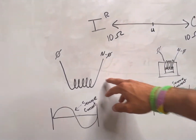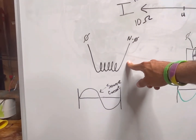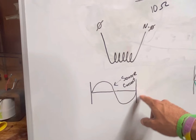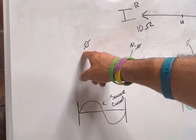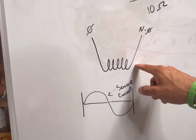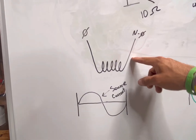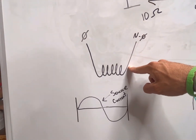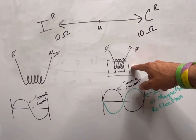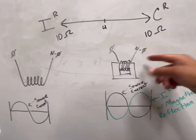Here is a snapshot of what's actually going on, looking at the sine wave between these two different scenarios. In this first one, we just have a regular coil standing alone. All we have on the sine wave is just a source current — it's completely unopposed. As we run current through this coil, it's going to rise and rise and rise, hit zero, and rise again. There's nothing opposing this other than the resistance of the wire itself, and with only that very minimal resistance, current flow is going to spike and it's going to blow up.